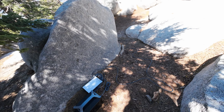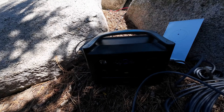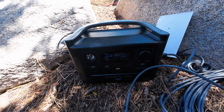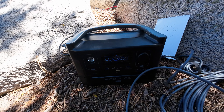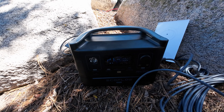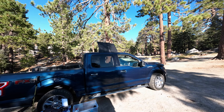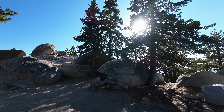The dish reorientated — okay, cool. This is only a 60-watt panel, but it will be enough to keep it topped up during the day. The panels are putting in 51 watts and Starlink is drawing about 30 watts, so this should pretty much keep it powered during daylight and should be enough to keep it up all night if needed. It's about quarter till five and the sun is starting to dip behind the trees.